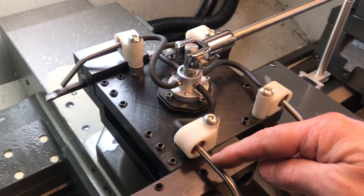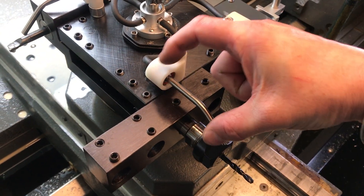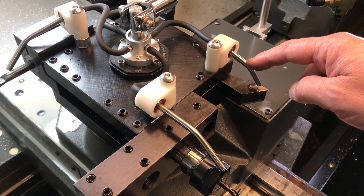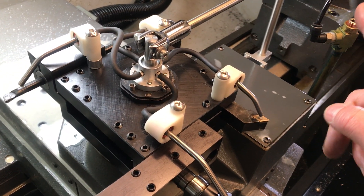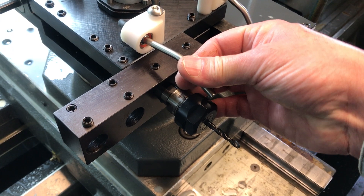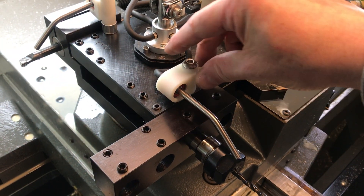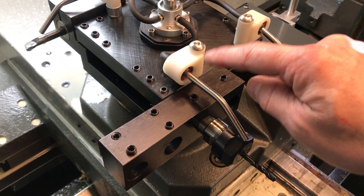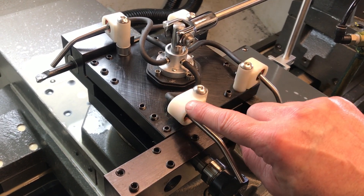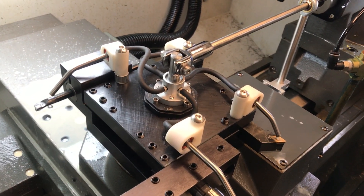The kit comes with 50mm, 70mm, 80mm, and 100mm nozzle tubes — all stainless steel. You get four 50mm tubes, two 70mm tubes, two 80mm tubes, and two 100mm tubes. These are firm in place but if you need to swivel them they'll swivel to any position — very flexible. Combined with the fact that each station will rotate and can be located on any of the five holes on any of the four corners of the turret, this gives enormous flexibility. The stations are also symmetrical so you can turn them upside down if you need to approach your tool from a different angle.